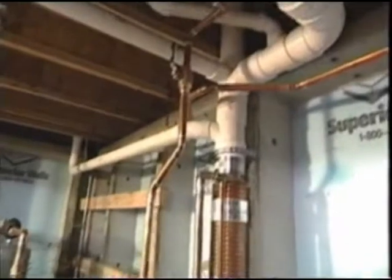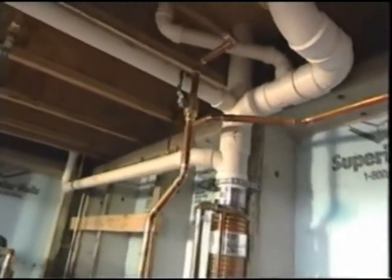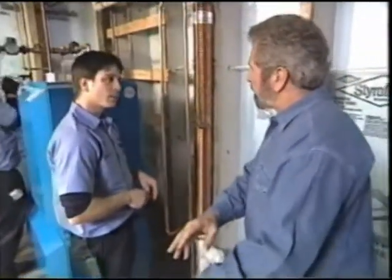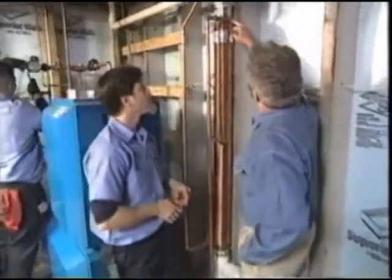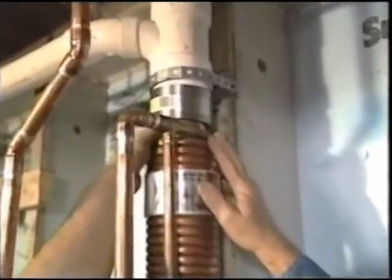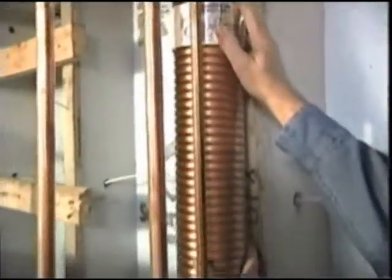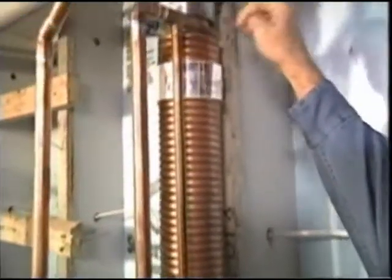It's so simple, it's hard to fathom somehow, but every time you take a shower, you're enjoying all that nice hot water, and of course, it's all going down the drain. It's still hot. Exactly. But it's now wastewater. And we're trying to recover some of that. Exactly. So instead of letting it go directly into the sewer, behind this coil is copper pipe, right? Yes, it is. The interior, this piece here, is copper extending throughout the whole coil. The exterior is the water supply piping that would be coming into the residence. So all of the wastewater from the whole house is coming out through here.